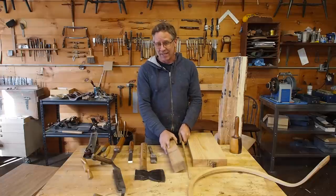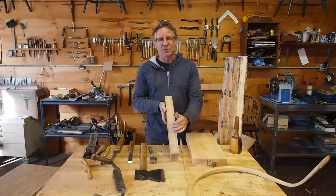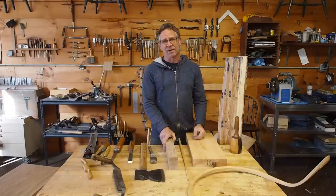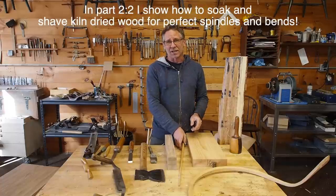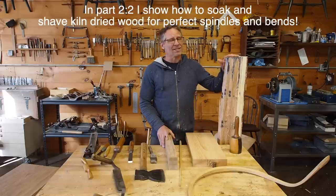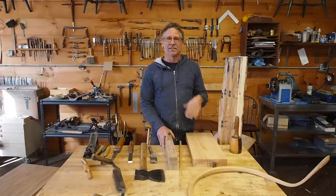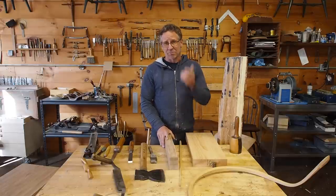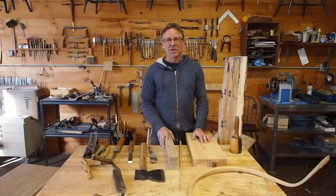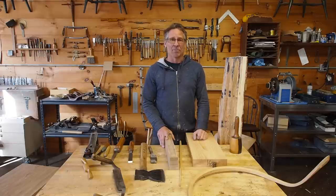That being said, I'm gonna show you how, if you understand what you're looking for, you can even take a board and saw pieces out to get a lot of the same results. I do know that there's a lot of parts I can make out of the board that are gonna be plenty strong, like for legs and things like that, because getting the same results that you would get if you'd split it from a log is not that difficult. And I like it because it's accessible, and it's actually pretty easy to work in a lot of cases, where sometimes, frankly, going out in the middle of winter and splitting a log isn't the easiest thing in the world to do. If you could get those same legs you're making out of a board, I don't see why you wouldn't want to do that, or at least know how.